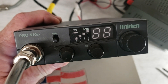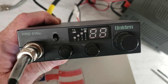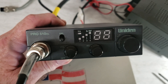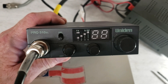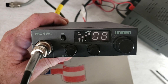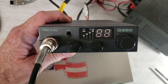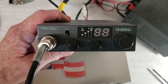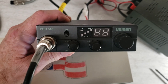So there you have it — the Uniden 510XL Pro. A $20 radio that swings to 20-plus watts. Talk on that radio and people will definitely hear you. Put that in your car and you're going to be the bell of the ball in the parking lot. Use it as a driver. Out of the box brand new, these don't even do 4 watts. I showed you how to get it to the legal limit, and then I showed you how to defeat the modulation control. So there you go — your $20 big bad radio.